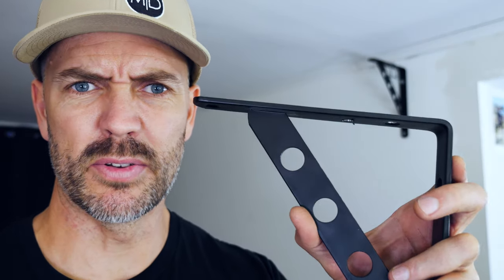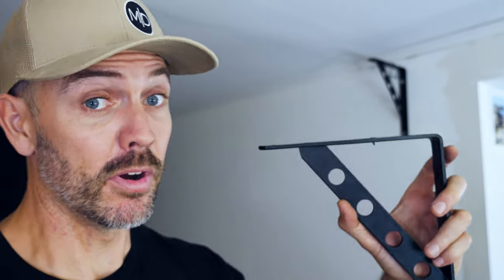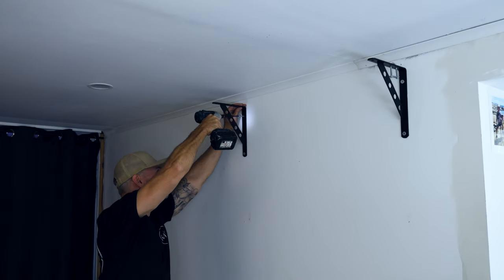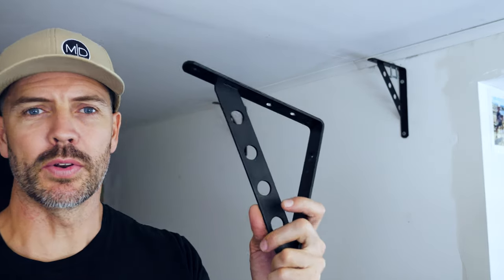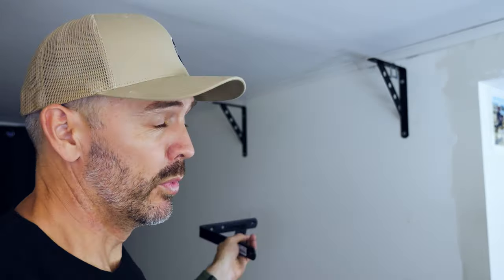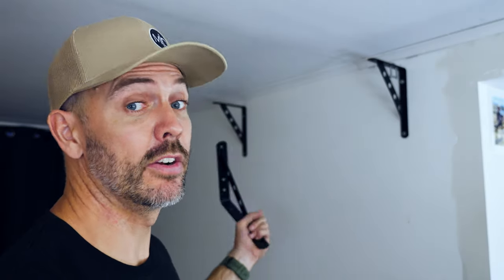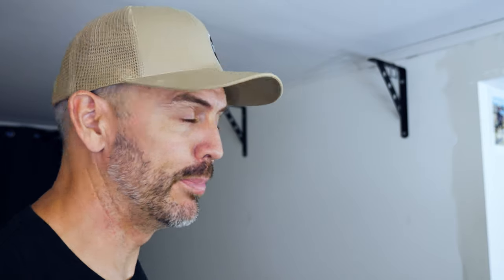I've just decided that putting those U-bolts in there straightaway is probably a silly idea — I'm going to be able to slide the clamp on a lot easier if I leave them off to start with. So I'm going to leave them off, put the bar on, and then put the U-bolts back in. This last bracket will actually be a little bit closer than I wanted because the stud isn't in the right place — 450 centres would have been perfect, putting one at the end, one at 900, then one at 1800. The pipe will hang on the opposite side but there shouldn't be any problem.